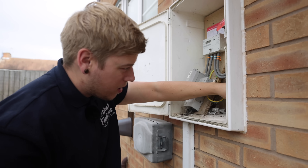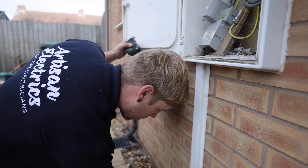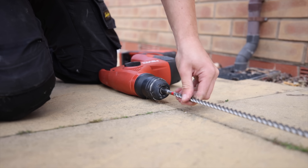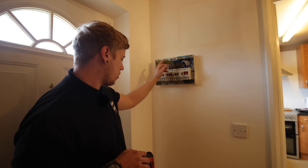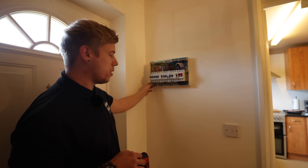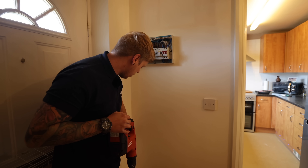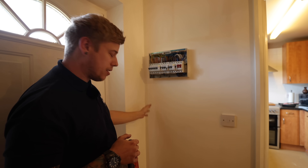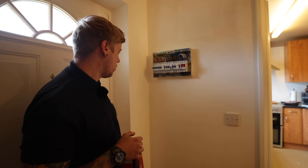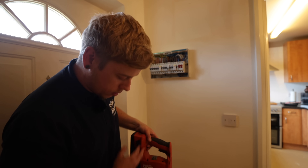So I was going to try to fish through this cavity into the meter box but the tail sort of winds round a bit - it wasn't really straightforward. Plan B: I've marked out roughly the bottom corner of the meter cupboard, so I'm going to have to do a bit of trunking from the floor up to the top of the board, do a 90, come in the side. At least the cable's concealed and not clipped on show. It can all be blended in since they're doing decoration at the moment. I'm just going to drill the pilot hole through now - this Hilti bit is great for that.